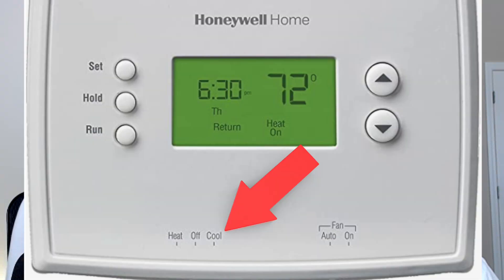Put a new air filter in, and then we're going to do a run test of the air conditioner — and we're going to do this well before you actually need it. We're not going to wait until it's 87 degrees or that first 90-degree day when 98 percent of the public turns the air conditioner on for the first time. If you can get a 70-degree day, that's all the better. Go to the thermostat and put it in the cool mode.